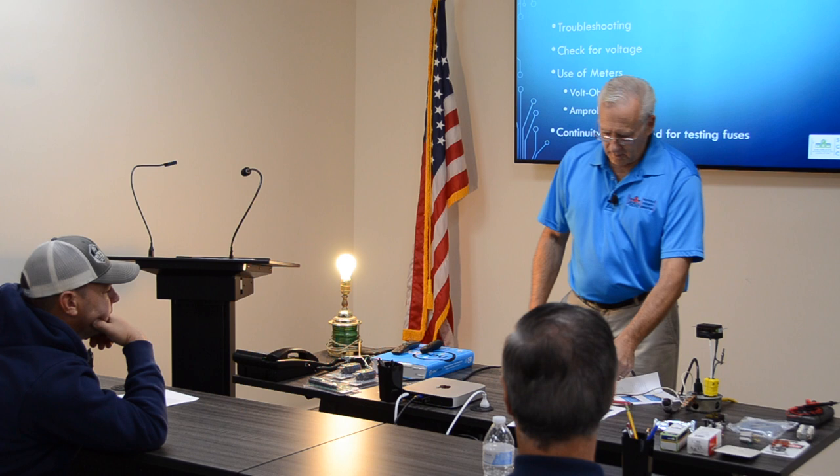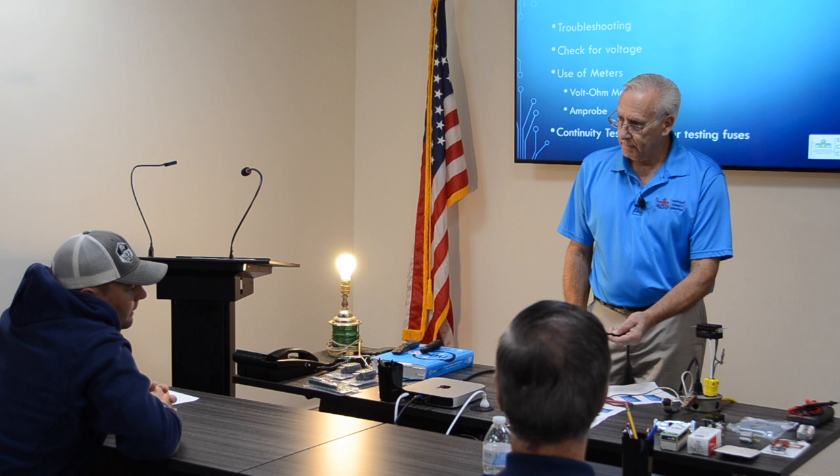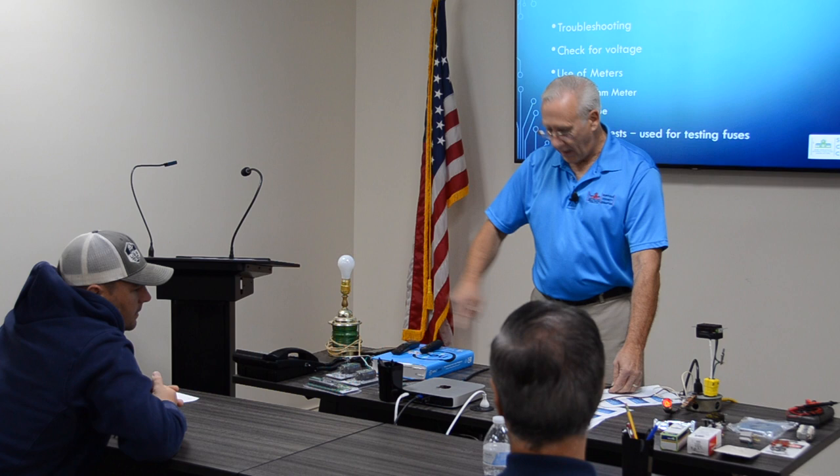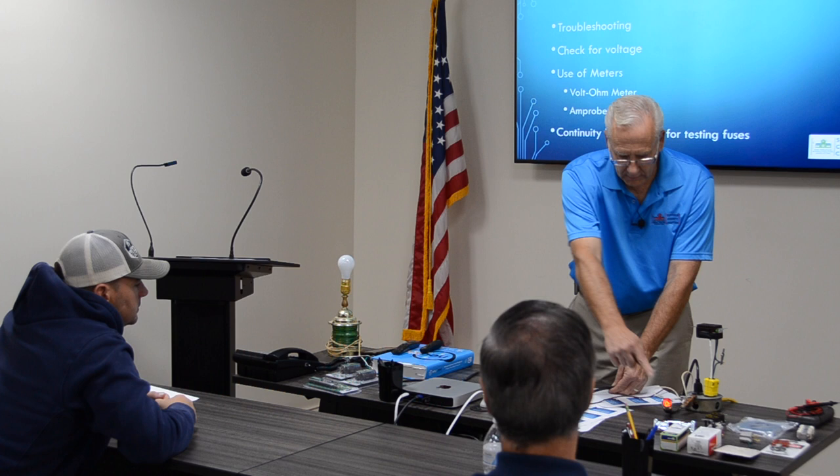Now, I didn't disconnect the hot wire. The hot wire is the black. Okay? I disconnected the neutral and the light went out. But one of those neutrals now is hot. One of those neutrals has got power on it. Right? You connect the circuit. Complete the circuit, right? Because the power is going down the black, going right through that filament, coming back on white, and getting right here, right to the light in that bulb right there.